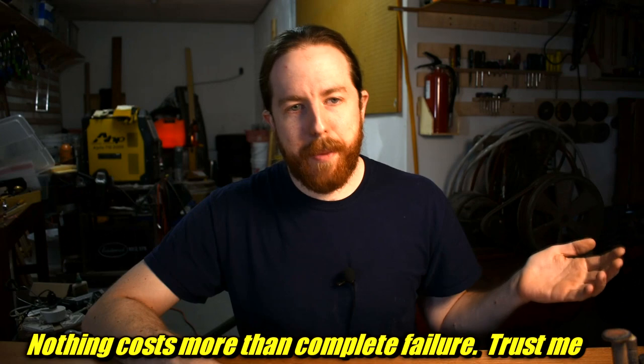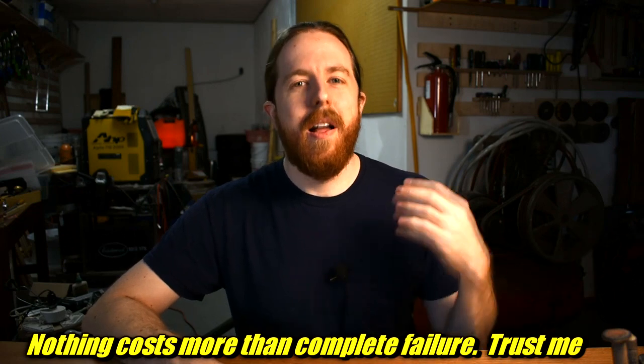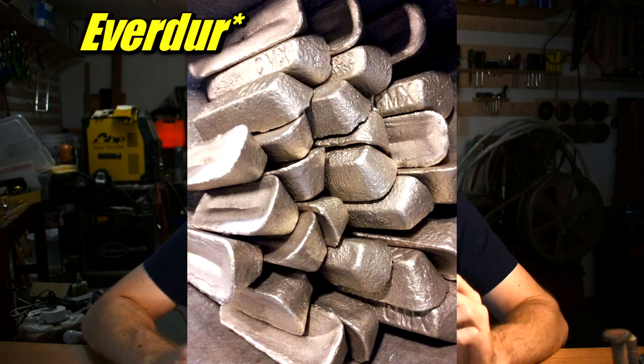If you're casting one of the copper alloys, you know, brasses or bronzes, probably buy it. That's the easiest way to get the right alloy. There's silicon bronze alloys, Everdure. I don't know how to pronounce it. I've only seen it written. That's really popular among people who cast bronze sculptures. So that's easy to find. If you buy the ingots, you will always get the alloy you want with no surprises, unless you go like Alibaba or something. Don't expect China to send you the right stuff.